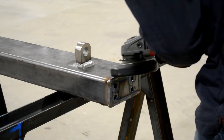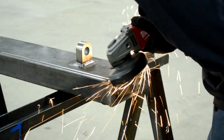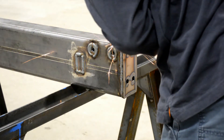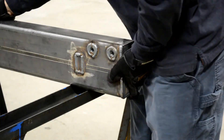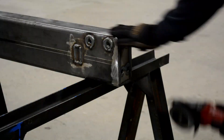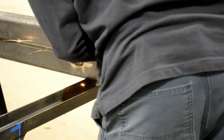Just taking my time and doing each side really slowly and consistently, making sure the weld looks as good as I can make it. I'm not a pro welder either, but I'm getting better each time. After those welds were in, the very last step for the bumper body is to blend those welds down into the front, back, top, and bottom faces of the bumper so it looks like those end caps are seamless — like they were always part of it. I think I got pretty close. It's not perfect, there's a couple little waves, but that trusty flap wheel does a pretty good job if you take your time.